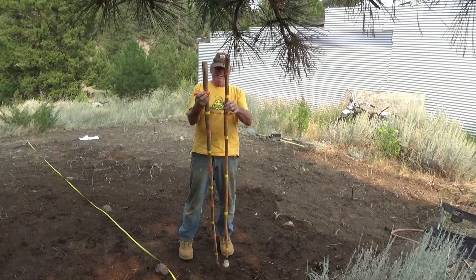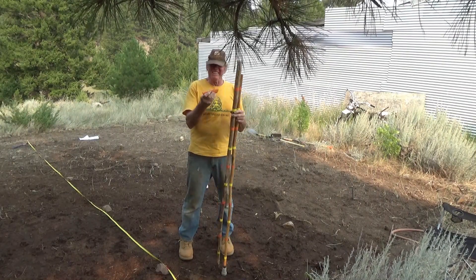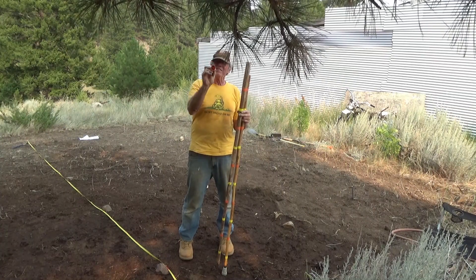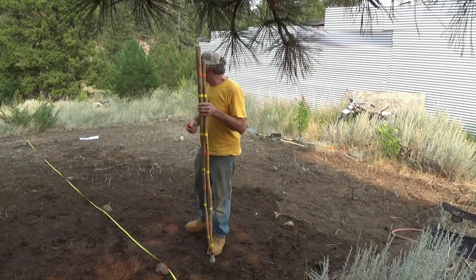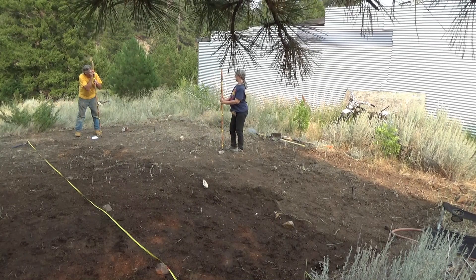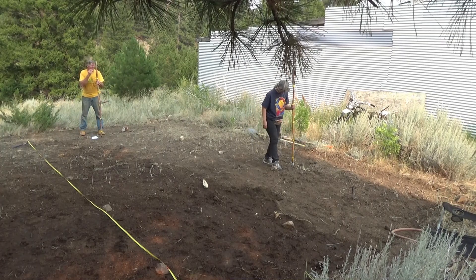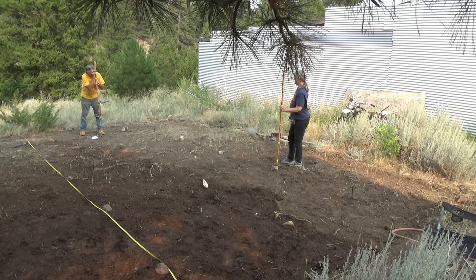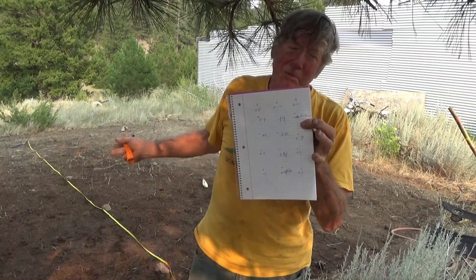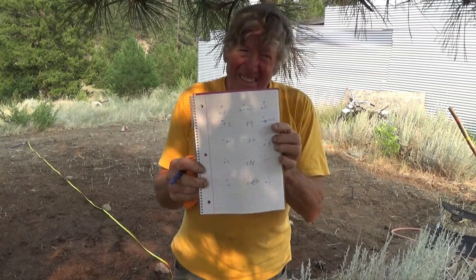Eva will walk around and as she puts the stick on the ground, I can tell how much difference there is in elevation. These markings are six inches apart. This has a little sight level right here — you see through it and you're looking at two things: a bubble level and the distance all at the same time. So let's go shoot some grades. Now I have a series of grades relative to the center end point, which was my target zero. It all looks pretty good — should be pretty easy to make it do what I want.